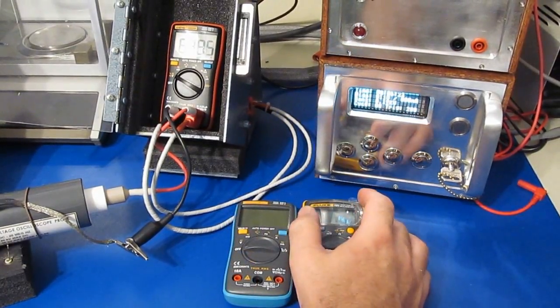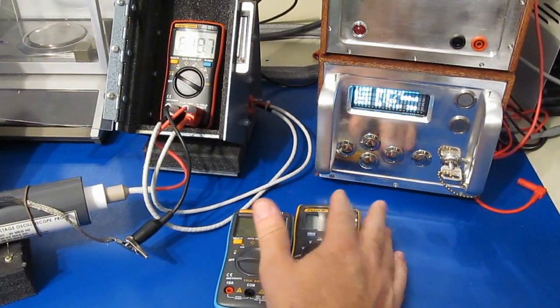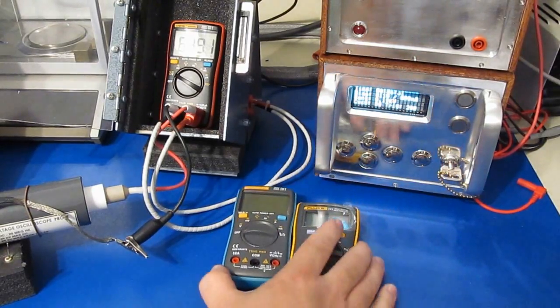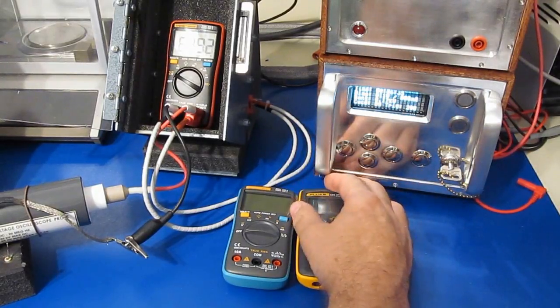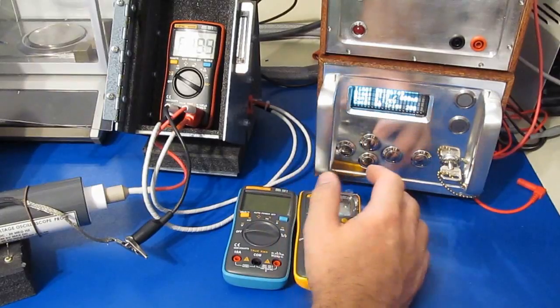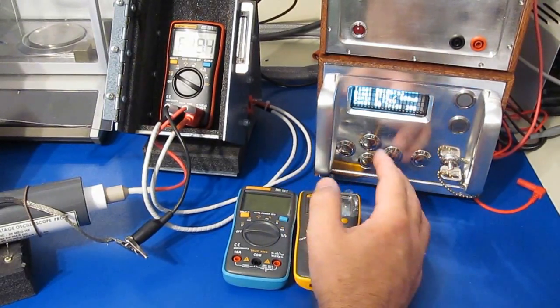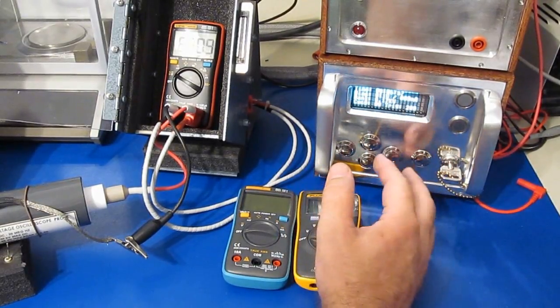I've seen a couple of comments recently about this testing. Again, I'm kind of surprised that people still bring this up. The comment was basically that I was directly discharging capacitors into these meters. Again, that's not at all what these transient generators do. So if you're really interested in what goes on inside of these transient generators, I'd suggest that you actually procure a copy of the IEC standard. In there they talk about the coupling network and how that all kind of works.